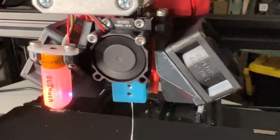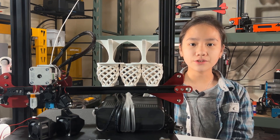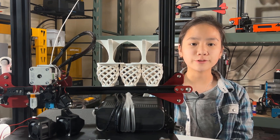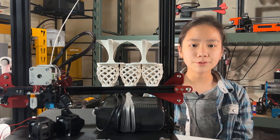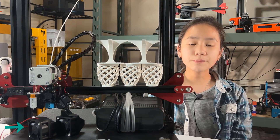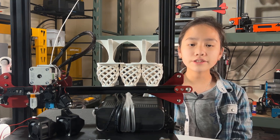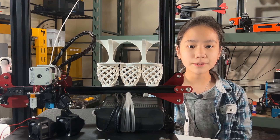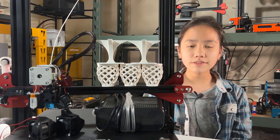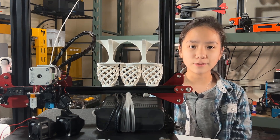I think I would just stick to the 30mm fans or the 8W air pump. In conclusion, this OMG direct extruder upgrade on the CR-10S Pro V2 is successful. This uniquely designed dual-gear extruder improves filament retraction and stringing, and the dual fans improved cooling. But from this experiment, using two powerful fans could actually make things worse. I hope you found this video useful. If you're interested in the OMG extruder, the website link and Thingiverse 3D model links are under this video so you can try to print them on your own printer. If you liked this video, please hit the like and subscribe button — my brother and I make a new video every weekend, so check out the channel on Mondays and you'll see something new. See you next week!